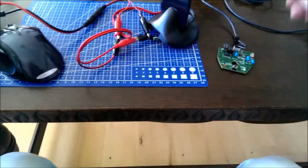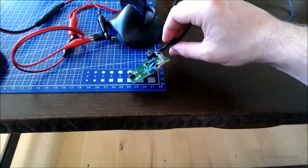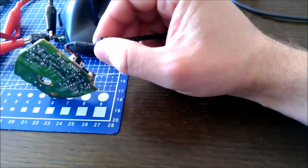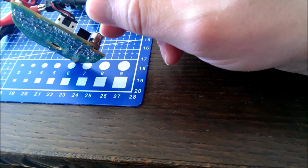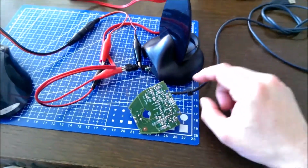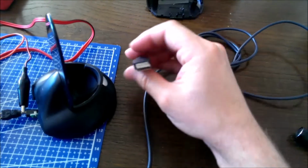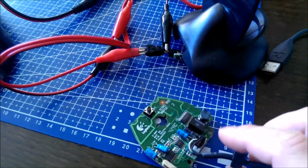So in order to figure out if this controller board was using the default pinout, which I suspected it didn't, since the rightmost wires were black and red, I used the multimeter in the ohm settings to see which wire was which according to the default pinout of the plug. And the black is ground and the red is V5.